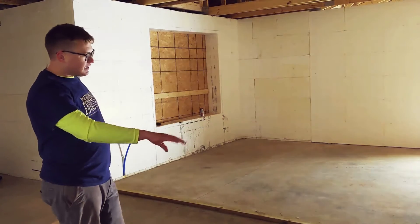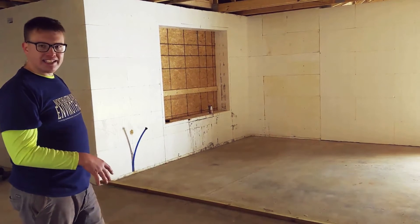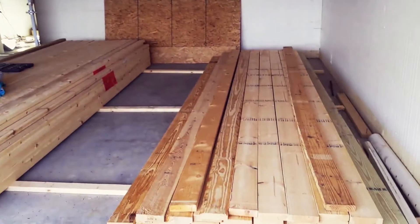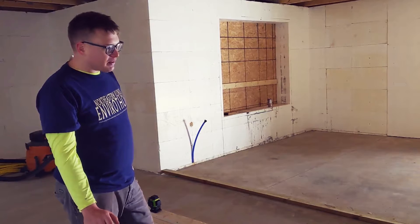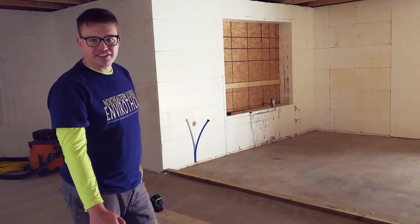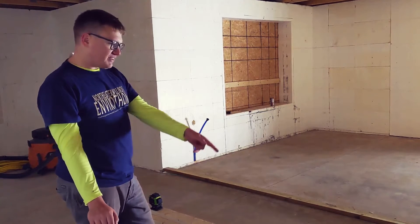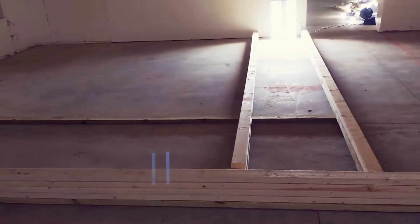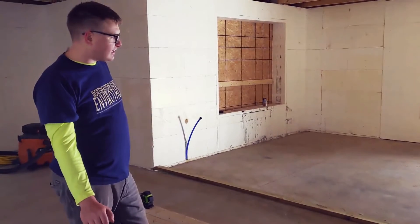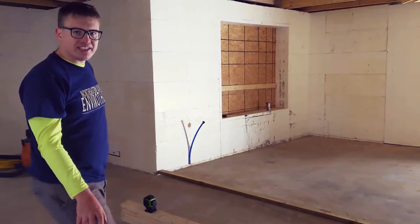You kind of lay down your bottom plate, your top plate, your double top plate, and you can actually cut them to the lines so you don't have to do any measuring — it's a lot faster. We happened to buy 16-foot lumber because lumber is crazy expensive again. It was like $12 for two 8-footers but like $13 for a 16-footer, so I went ahead and got the longer lumber. As you can see, we don't have to split a single top plate — every single one is long enough to capture the entire wall. It also saves you on studs so it might end up being cheaper because we don't have to tie two walls together.